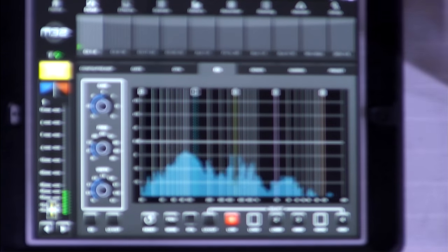Now, I'm not going to bother to do it right now, but what you can do then is go ahead and find that notch. Remember, on these digital mixers, we have this ability to go in and select a frequency. We can make something called a notch filter and just knock that little frequency out. This is called ringing out a system. And so what we do is we go down the line and just keep notching various frequencies out that are problematic. Feedback occurs because a speaker is pointed at a microphone, and there's actually like a loop or a cycle of this thing.